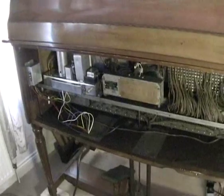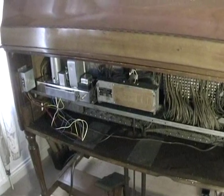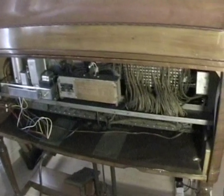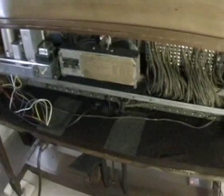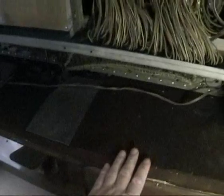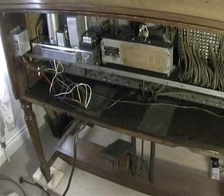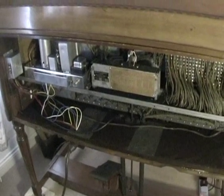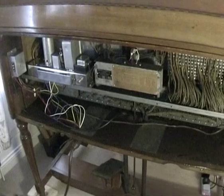There's the generator underneath. This is the Model AB — the A standing for the original Model A innards, very much the same as the original Hammond, but in a B cabinet. When they introduced the Model BC, this extra space was brought in to accommodate a second chorus generator. In the Model AB, that was left out, making it a cheaper model. That space was then perpetuated right through to the B3, where it was utilised for the AO28 preamp.